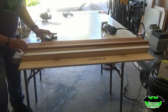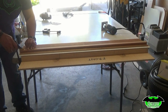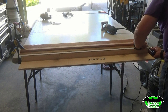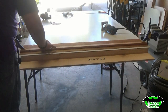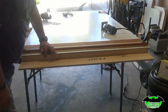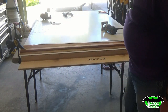We're going to take our jig, set it all along here, and line it up with the edge of our quarter-inch plywood. We'll get one side clamped, come back to the other side, and line that up where it needs to be. Just to double-check, we'll lay a straight edge on here, see where we need to be, check the other side — it looks good. Now we'll just take our trim router, run it along that edge, and be done.